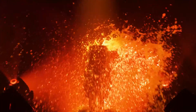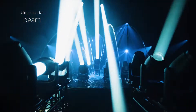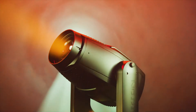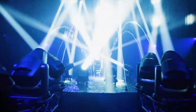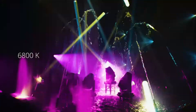Superimpose, combine, and create excitement. Well-suited for indoor as well as outdoor use, this luminaire will concentrate everyone's attention with its ultra-intensive 2-degree beam, opening up new horizons with an impressive 21-times zoom. Take it to the next power level with a brand-new ultra-compact 450-watt monochromatic LED emitter, specially developed for long-distance applications, delivering a luminous flux of 18,000 lumens at a color temperature of 6,800 Kelvin.